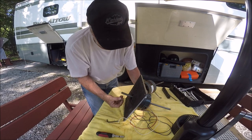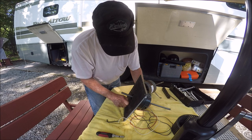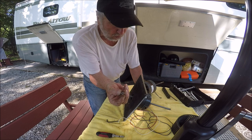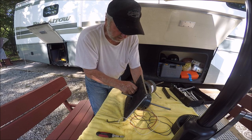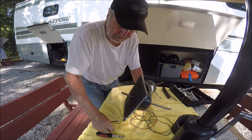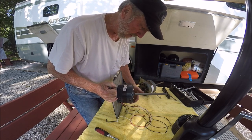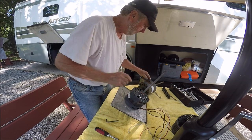I'll start with the bottom and put them on just finger tight. Notice there's a star washer — a lock washer — so put it toward the base. It goes right back into the place where it was. Just snug it up, then the other one down with a nice firm tightening. Now we've got everything we need.